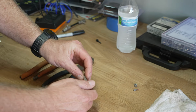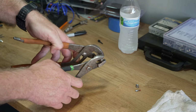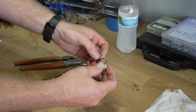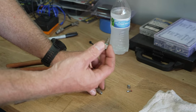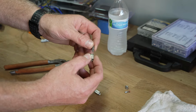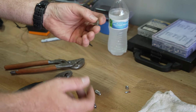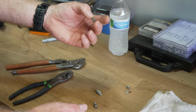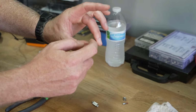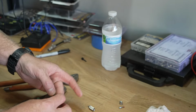And then the next section that we're going to open up, again, you probably have to use pliers. We have a filter that's built into these nozzles. This is a mesh or stainless steel filter. How we're going to clean it is real easy: separate it, and you can use your faucet or water hose, hold it, and blast it with some water, which will clear up any debris or material that's stuck on that filter. Once it's clean, we're going to reassemble.